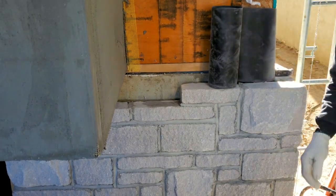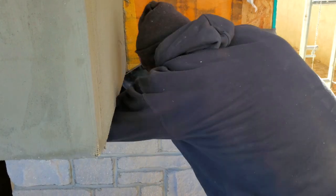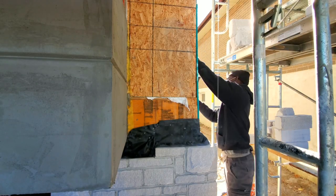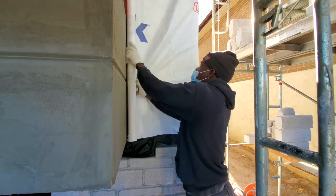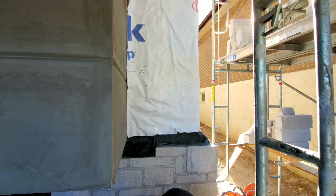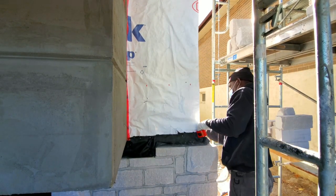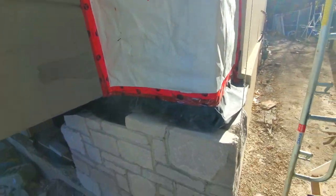As I mentioned, this mortar dries really fast so we have to joint as we go. Here we're installing our weeping plastic — normally we step down six inches from the bottom of the plate. We're also installing our Tyvek: usually six inches above our weeping plastic. After installing the Tyvek, go ahead and tape the joint right along, making sure it's nice and sealed to prevent water from getting in.